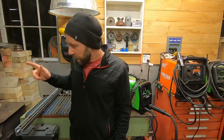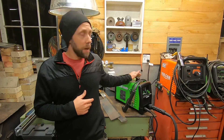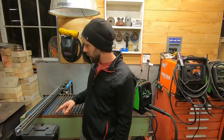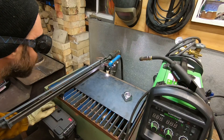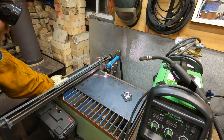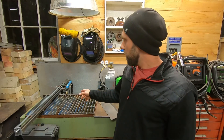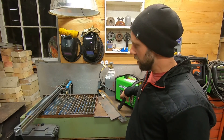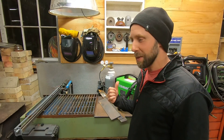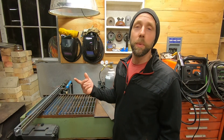I built a plasma track a while back that I've just been running a little tiny plasma torch on. I'm going to hook this thing up here in the next few days and run some tests. It's got a control box, a pulse width controller, and you put a torch in and can control nice square cuts - works like a chop saw. You can do 90 degrees, it's got a fence, and you can do up to 45s. I'll need to figure out how to control the plasma torch remotely rather than with the trigger switch for the CNC.